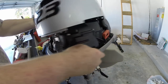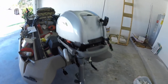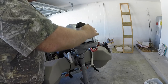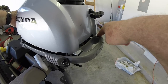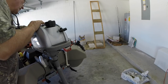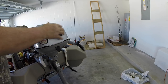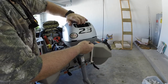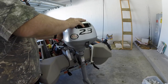Now let's put the cowling back on. Sometimes it isn't the easiest thing. Get your rope so it's not around anything. This goes right over the top. Those two little feet have to fit into these slots — you can see when it pops out you want them to be in there. This little rubber thing has to go down into this slot as well. Make sure the front is in, then this sets back down. Pull down on the strap and now you're locked back in again — it can't go anywhere.